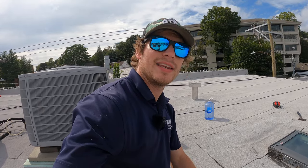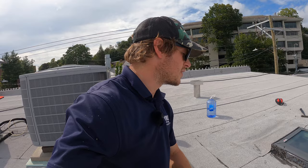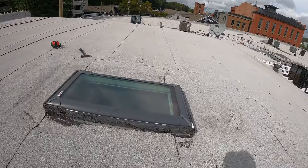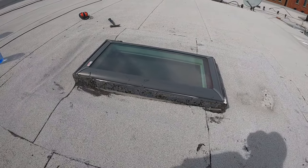What we're going to do today is take out this improperly installed skylight — it's the wrong skylight — and put in a proper flat roof curb mount skylight. We're also going to change it over to a standard size, so that if there's ever a leak or a problem, it can easily be replaced within a couple of days rather than waiting two weeks to three months. Using a non-custom standard size saves a lot of money and makes the job easier.